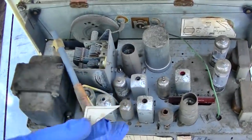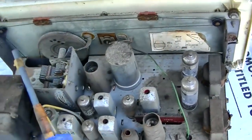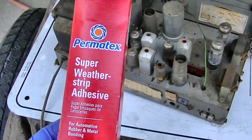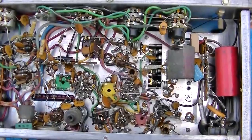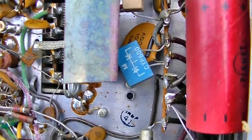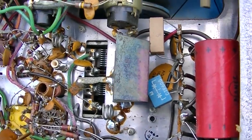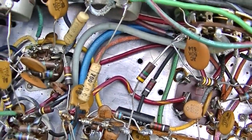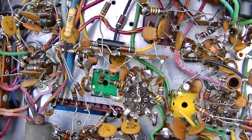I tried to gently blow it off and avoid all these stickers, but the air just blew it off. So let me try and glue that back on - I like to use this stuff to glue stickers back on old radios. I think I got this at Napa. Okay, let's take a look inside. I don't think I see any paper stuff. I don't know if that's a selenium or not - it might not be, it's awful small. That might be a double silicon diode on a center-tap transformer. It is all ceramic disc capacitors with the exception of those little white things right there.